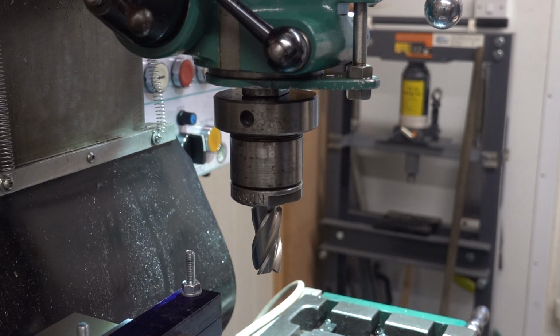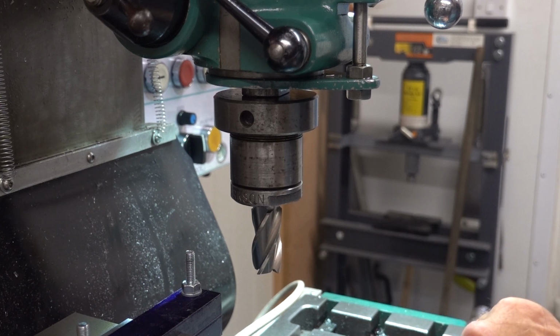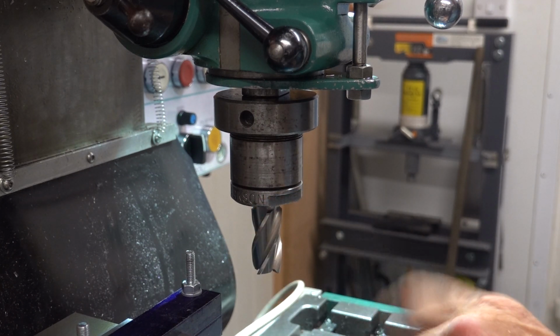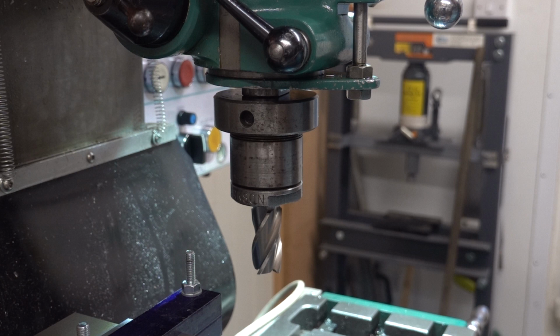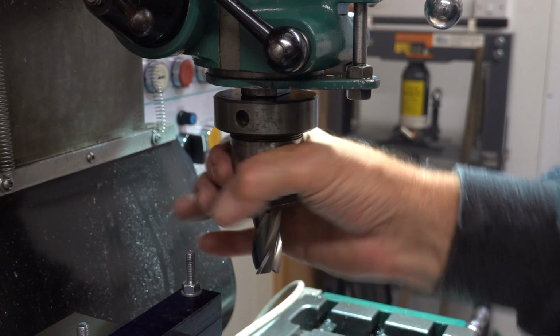And I've used it quite a lot because it's a very, very stable and rigid setup. I'm not saying this ER25 collet I've got isn't any less of a beast, but you can't knock these. They're just that old, and I suppose in industry they still use a similar sort of idea, but you can pick these up fairly cheap now because not many people use them. So my next job is I need to know half the size of that cutter. Well, that's easy because it's 3/8 of an inch, because it's a 3/4 cutter. I'll double check it, make sure it hasn't been reground at some time or other, and then I'm going to do my calculations so that I don't plunge in too far or too far that way, and set my stop up. I just thought I'd show putting that in because a lot of people do ask questions about them.